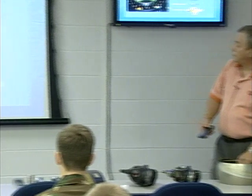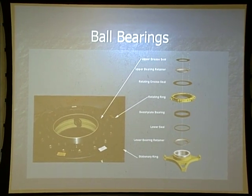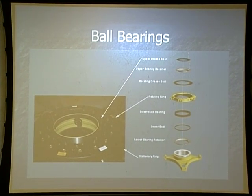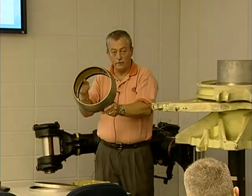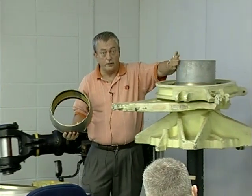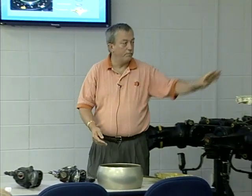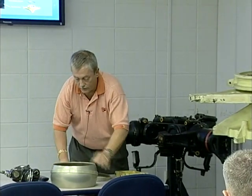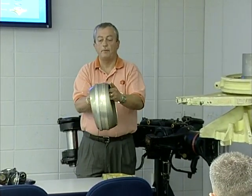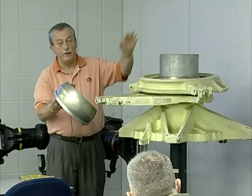The uniball sits inside the stationary ring and slides up and down when we make our movements. Inside there is Teflon, and that's another reason Teflon and grease do not mix well — the grease will eat that Teflon up and then start eating into the slider assembly. The ball is kept inside the rotating ring, popped in with a couple of rings at the top and bottom that keep it from popping out.